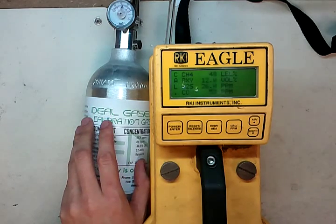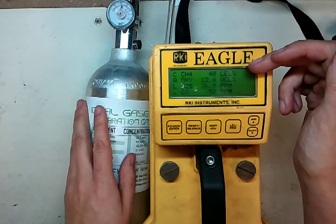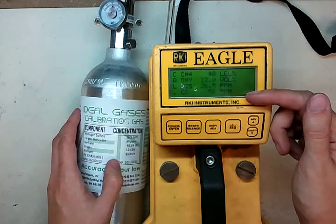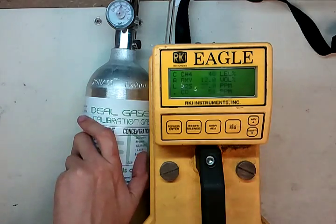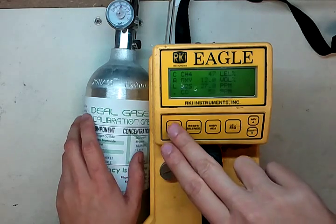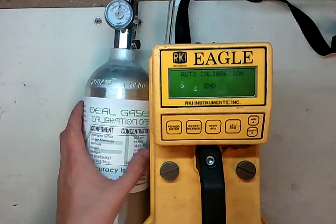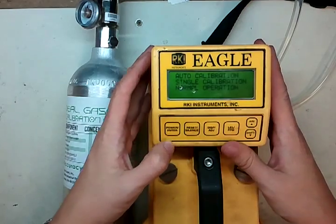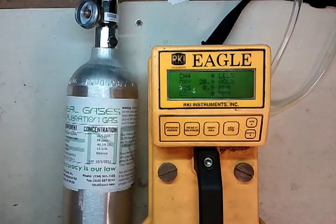About 30 seconds remaining. Watch here — see how the numbers aren't exact? It's not exactly 48, it's not exactly 50. We've got our 12%, 26.5, and you notice these values are all extremely close to what's on our cylinder. It might be just a little bit off, but that's okay. About 10 seconds remaining. Now we're just going to hit enter — press that button. Values will stay for a second and it will say 'end.' Once that's good, detach your hose and go down to normal operation — down key twice and then press enter. It'll usually go into an alarm, sometimes not, depends on how much time you gave it.